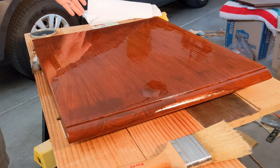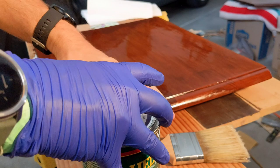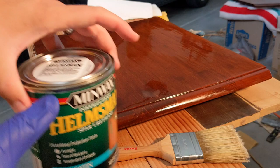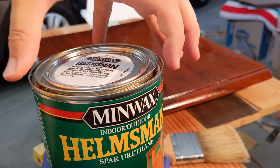Remember, nitroglycerin — pretend that your polycoat is nitroglycerin. Do not shake this can ever; only gently stir it with a paint stir stick. Make sure you close the lid. I had a can dry out once — I just pushed the lid on when I was tired. You need to hammer it down with a screwdriver or a rubber mallet. Minutes later, it's already starting to dry. Looks to be a smooth final coat — I caught all the drippage, no puddles, no lines.